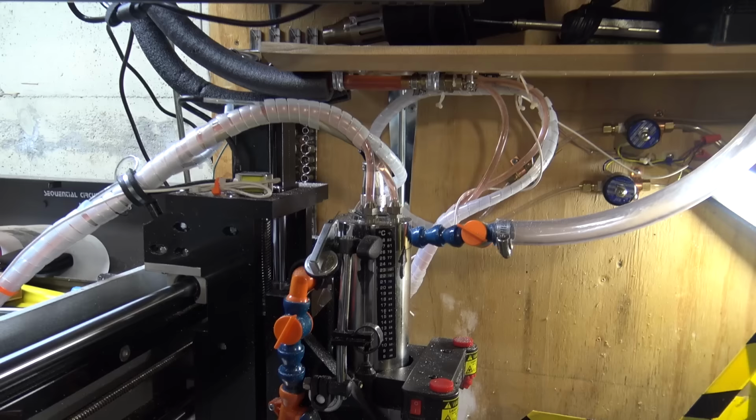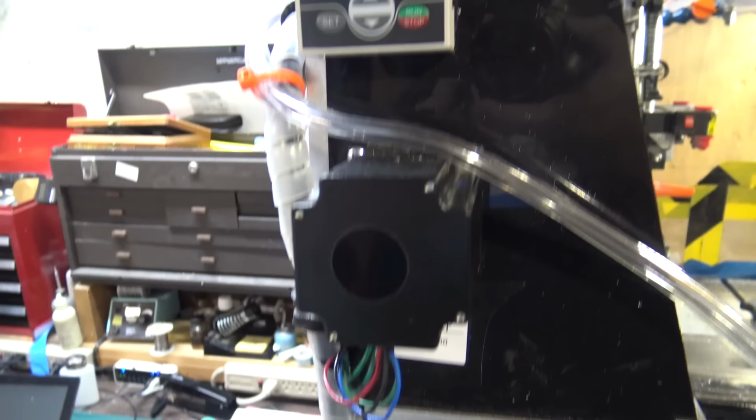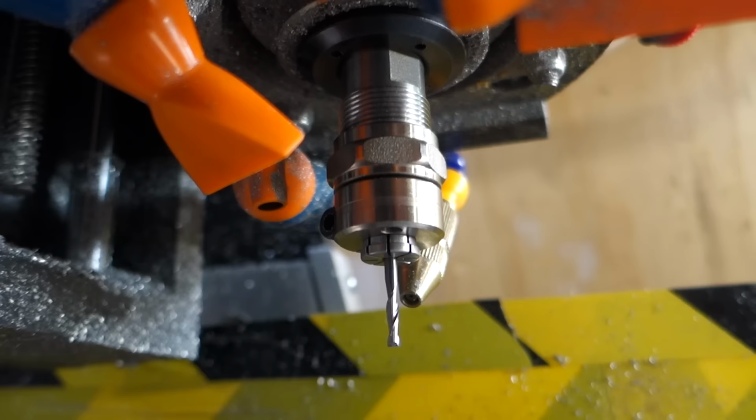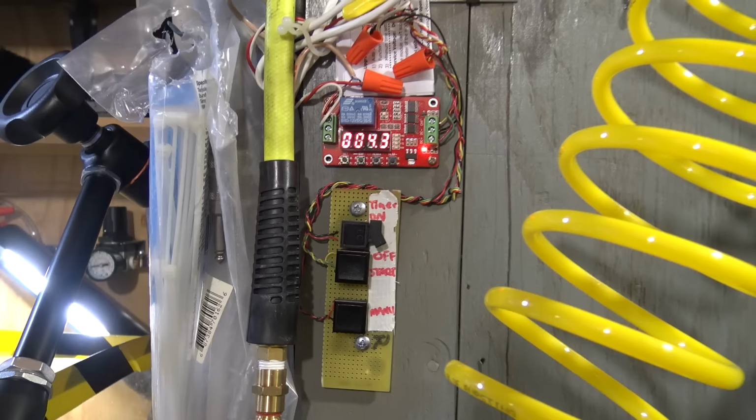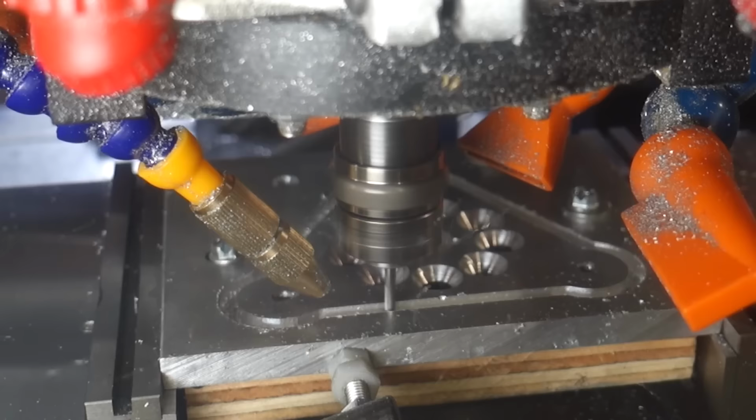Okay, my CNC machine is a Next Wave Automation is the company, and the machine is called a CNC Shark HD2 Plus. God knows what the other version numbers are. Fancy. Yeah, exactly. Effectively, it's a three-axis router-based CNC machine. It is in part made out of plastic, so a lot of things you have to be very gentle with it, which actually makes you a better machinist, right? Because you don't have a machine that's completely unlimited and you can effectively break it, right? In order to get good results, you got to be nice to the machine.